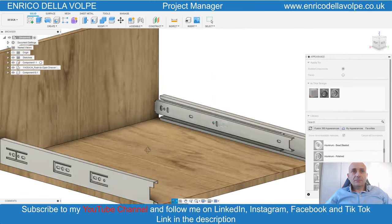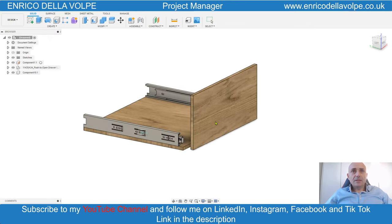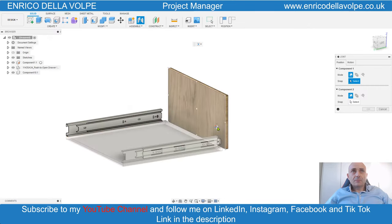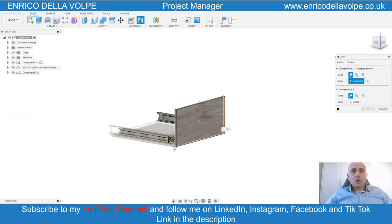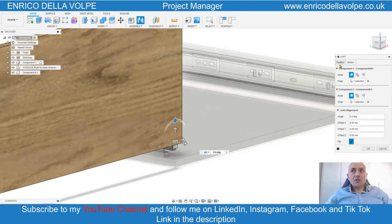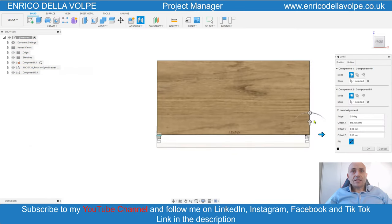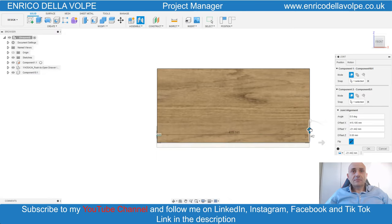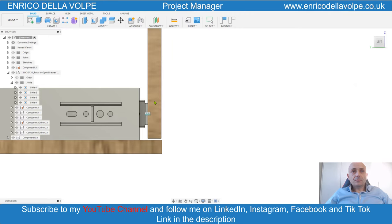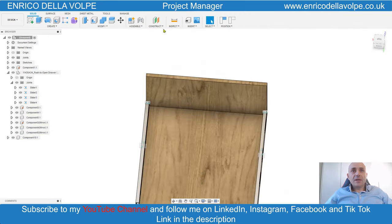Now take the other runner, disassemble and reassemble in the same way as the previous one. Fix the front drawer to the runner using the joint command, rigid motion, and enter and adjust the distance. Now we are ready to create the base of the drawer.